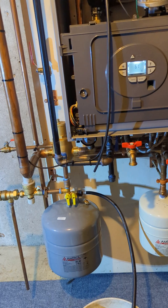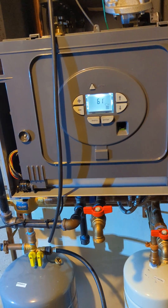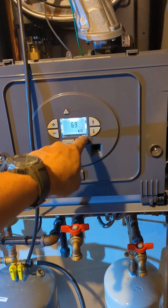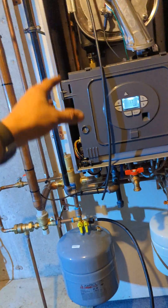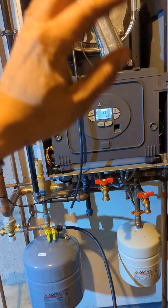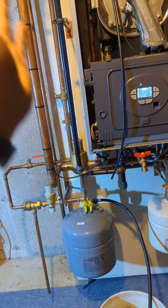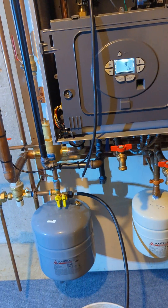You're using an outdoor sensor — not an external thermostat, a sensor. When it's not very cold outside, it goes up to 130-140 degrees. When it's really cold — I programmed it around zero degrees — it goes to maximum temperature, about 180 degrees. That's how you get the efficiency; it's called outdoor reset. The technician said you must have a problem with your outside sensor. I said there is an outdoor sensor, but it's not a thermostat — it's a sensor. We fired up and the temperature's going up.